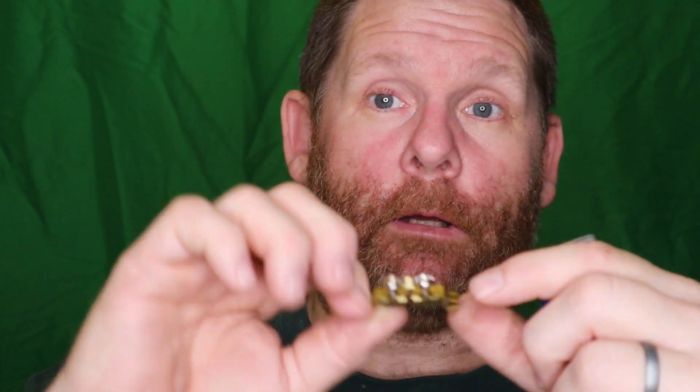It heats up, contracts, expands — like I said, it's just a vicious cycle. If you have the wire wrapped around your screw and you tighten it down, you will know pretty much immediately that it's either going to stay or the screw is going to strip out — there's no in between. I would much rather screw that screw as tight as I can get it and strip it out, knowing it was a faulty screw. Then I can try the next one, and if that doesn't work, replace the receptacle. I would rather know when I put that receptacle in the wall that it's a done deal.